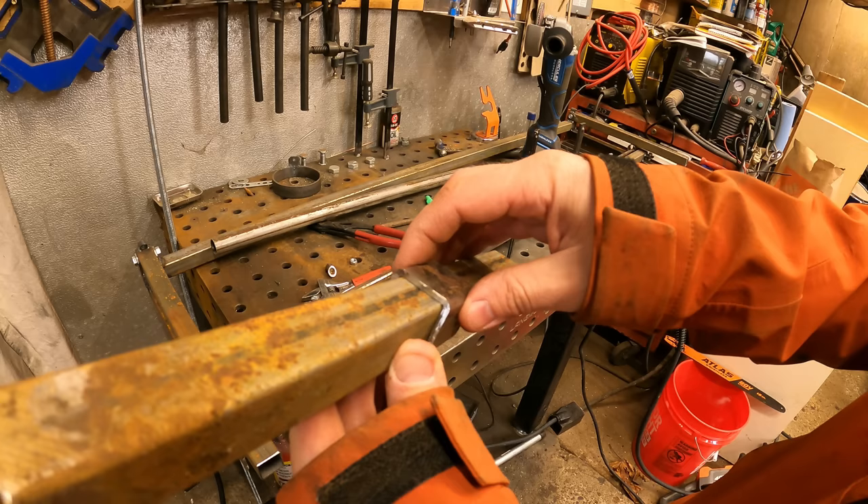For me, I'm just happy about having another type of siding for some of the outbuildings here. I'm going to show you a ceiling I did with some salvage lap siding I got years ago — it's tapered from thick to thin — and another ceiling I did with just three-eighths boards thick all the way through, both laid on like lap on a ceiling. It's really hard to tell the difference when they're up. So if I spent $1,000 on a lap siding jig, I don't think I'd feel like I got my money's worth. But what you do gain with that taper is you get a little bit more out of each cant with that teeter-totter effect — you get thin to thick boards and probably a few extra boards per cant. If you're getting a little more product off the cant at the end of the day, it's probably worth it.